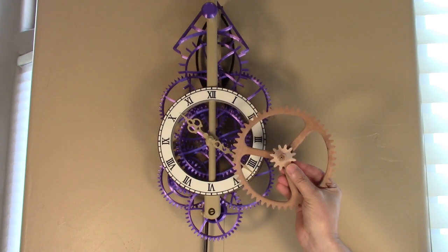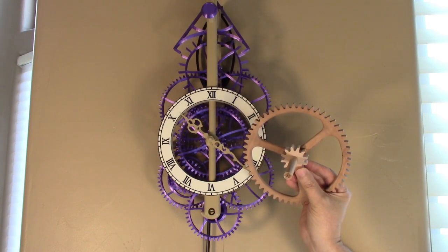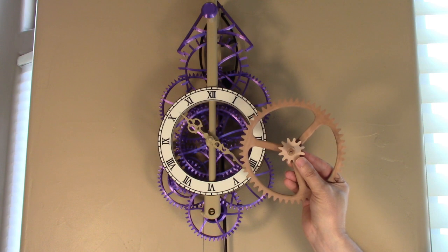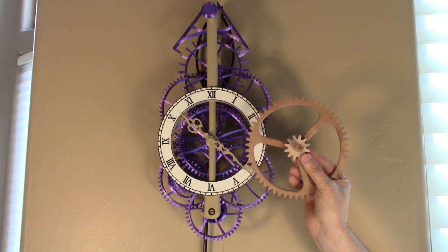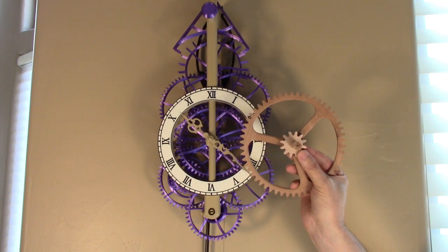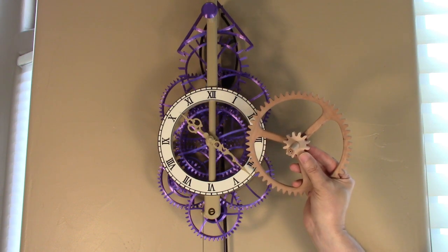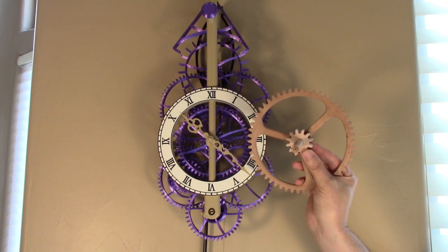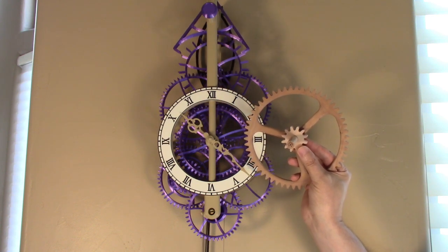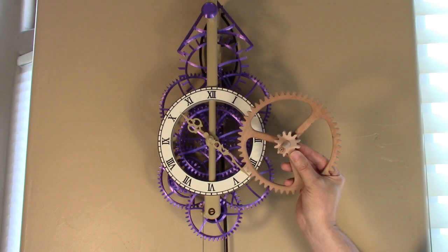Another thing I'm planning to do is at some point convert this design into a wooden gear clock. This is still a work in progress, but I think the design can be ported. These gears are about 1.25 times larger than a similar sized gear in the 3D printed clock. I'm not sure what it's going to do to the run time — I might end up around 3 or maybe 4 days, but probably closer to a 3-day run time. This is a solid wood gear, and I'll be describing the process of how I made it and how it will avoid changes with humidity to make a functional clock gear that doesn't get distorted during winter or summer.